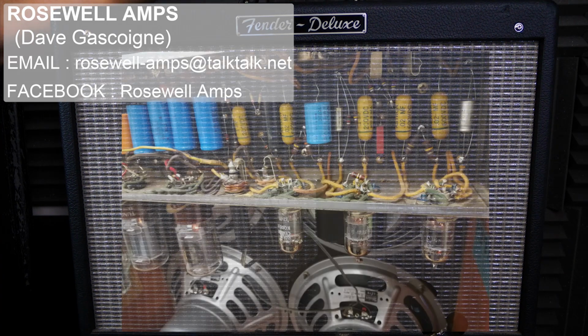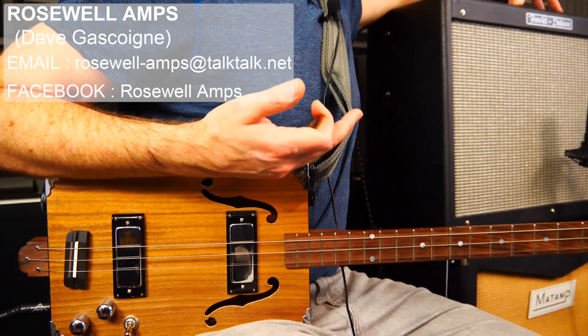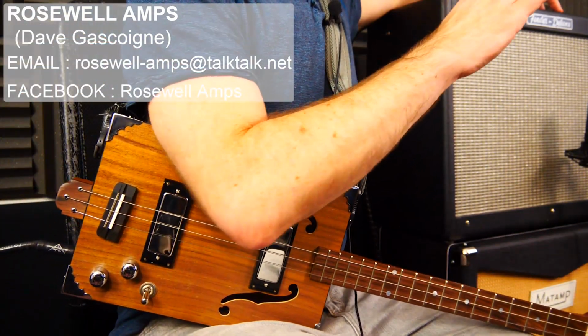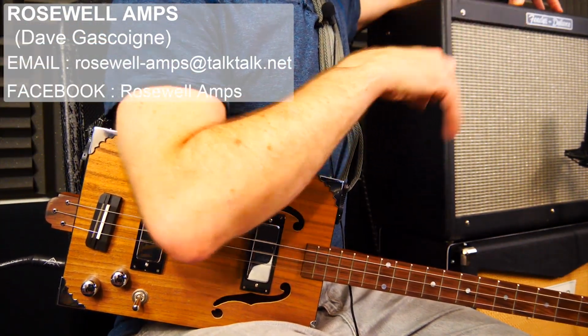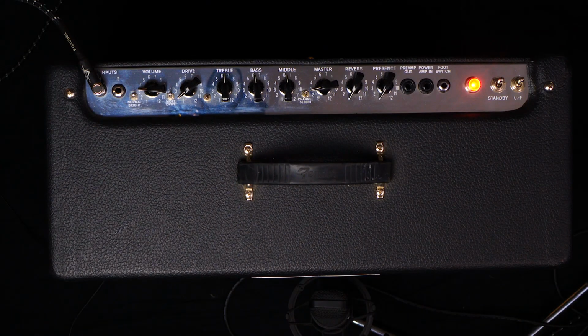So these use output valves which are 6L6, so they're a little bit different to the EL34s. There's more headroom. They can cope with more power before they start to distort, which is why people typically associate Fender sounds with being more clean and Marshall with being more distorted. It's a combination of the pre and the power amp stages, but you can typically think of it in those ways.